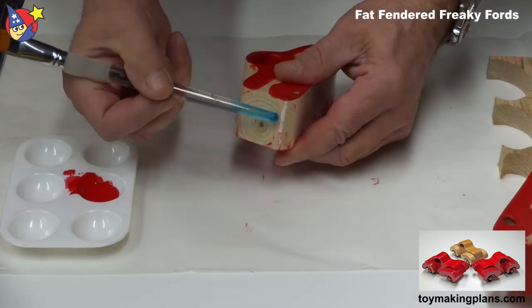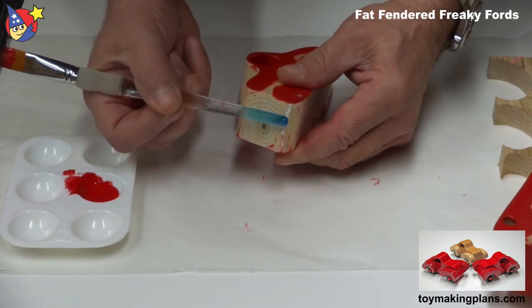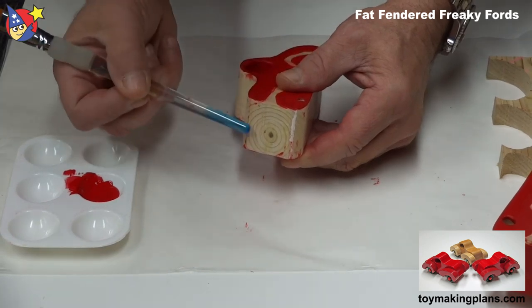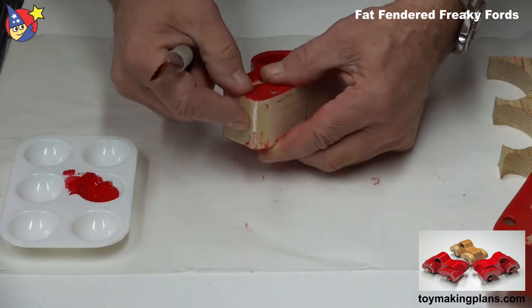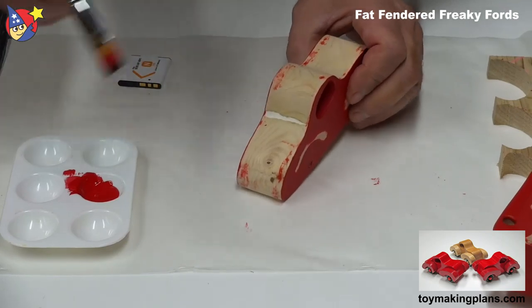And the same problem here. The grain direction you can see from the center is out. But no problems here because it's routering in this way, pushing down and coming out this way. But here I got some tear out. Not a problem, I just filled that in, sanded it down, and we're good to go to prime, or paint.